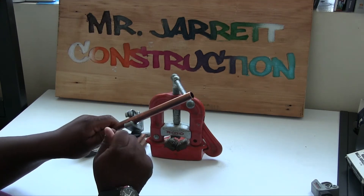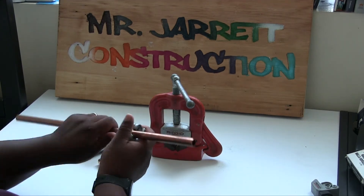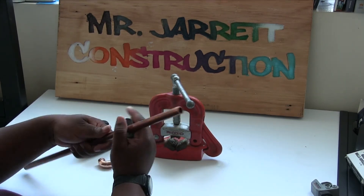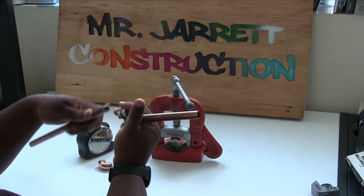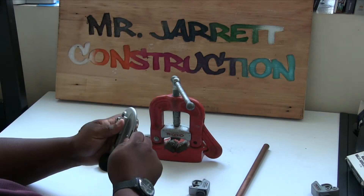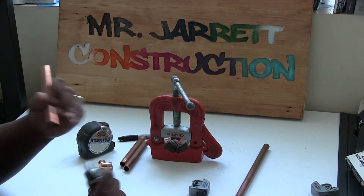You want to tighten it up but not too tight, because right now we're just scoring. Then you're going to rotate it, loosen it up, tighten it a half turn, rotate it a little more. Slow and steady wins the race — there's no rush, take your time. So right now we've got it cut. Our next thing is what we call reaming the pipe, where we take out all the little burrs from when we cut the pipe and clean that out.